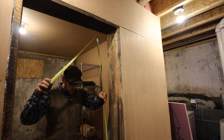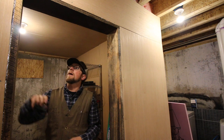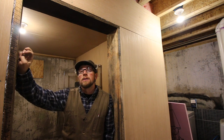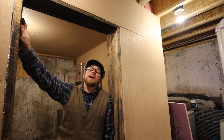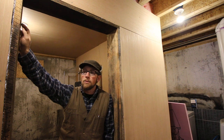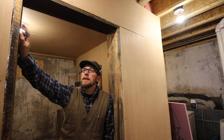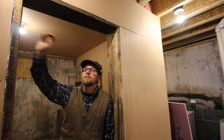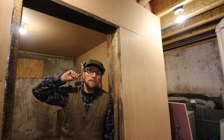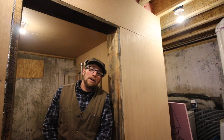75 inches for height — so I'm looking for about an eighth inch gap per side. I'm going to cut the length at 74 and 3 quarters. For the width we had 28 and a quarter, so if we go 28 we'll have to do some funky weather stripping to get a tight seal. So keep those numbers in mind — let's go outside and cut our 2x4s down to the right lengths.